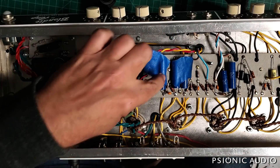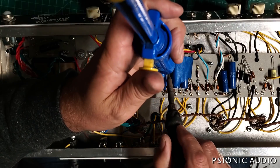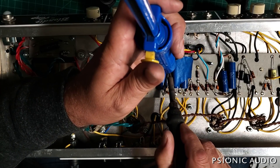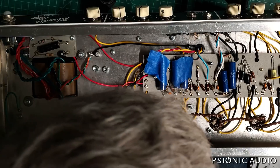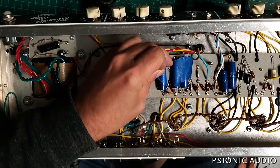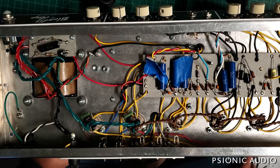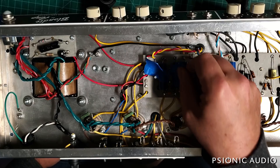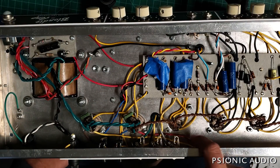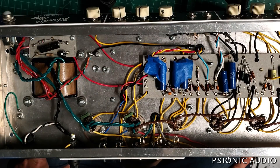Hopefully the builder has some wire in there that I just can't see, at an angle over that eyelet and not just floating - I hope that ground wire has not come out. Good, it's still there. So I'm going to have my ground wire coming here to the pot, and that'll be the lug one connection on each of these. We'll have the two grids going to lug three on each side of the dual pot.